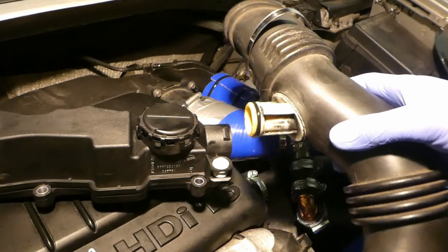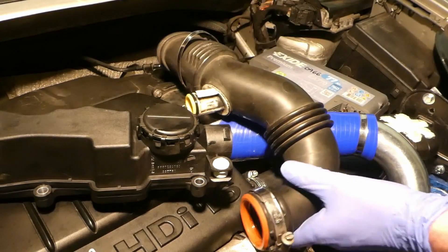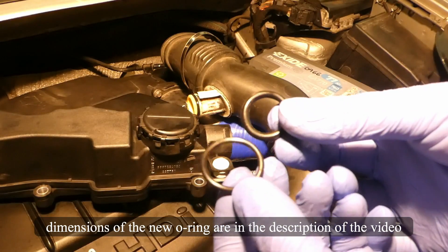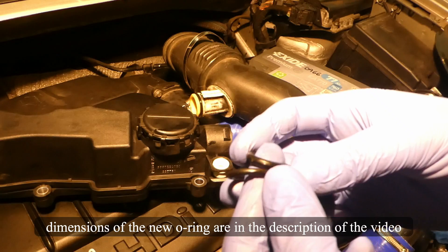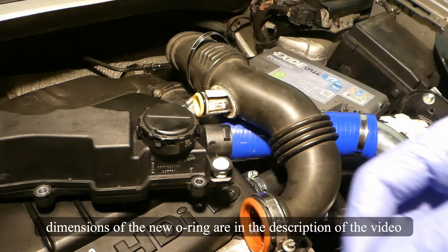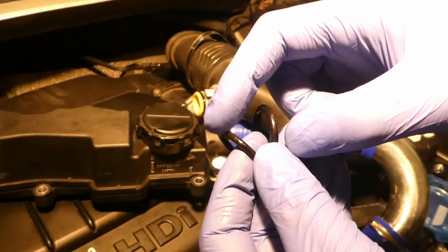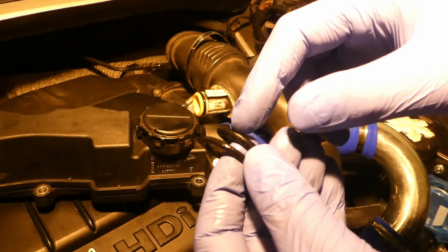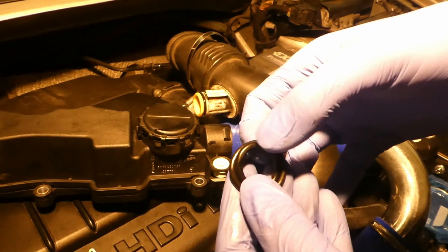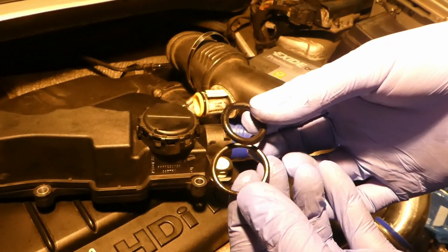In order to make a tight seal, I suggest replacing this with a much fatter o-ring. This is the original o-ring and I'm suggesting replacing it with a fatter one to make quite a good seal. The original is roughly 3.1 millimeters thick, and this replacement is 4 millimeters thick — it makes a much better, actually perfect seal. In the description I'll put the sizes of all these.